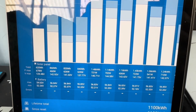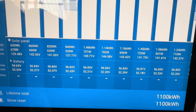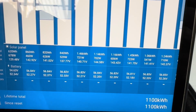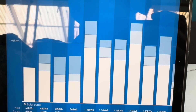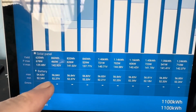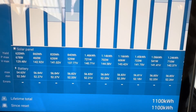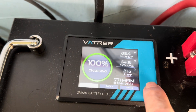Looking at the log for the 48-volt battery, you can look at the battery voltage and you can see straight across every single day I'm hitting 56.8 easily. Got 700 watts of solar driving this battery, and I use it every single day pretty much. But with that 700 watts, every single day it gets up to a nice full charge. I'm already at 100% full earlier in the day.